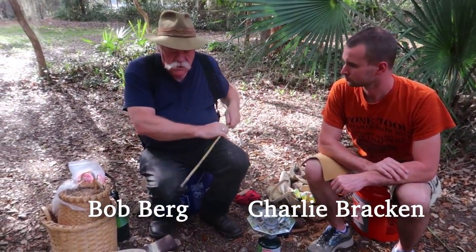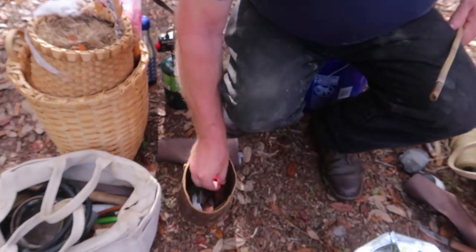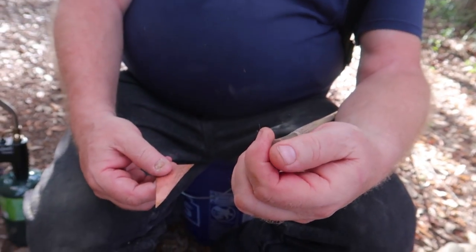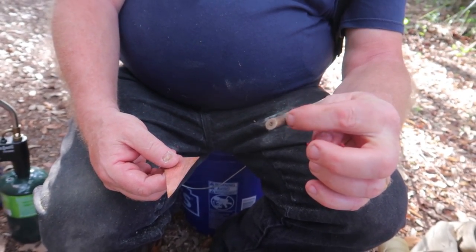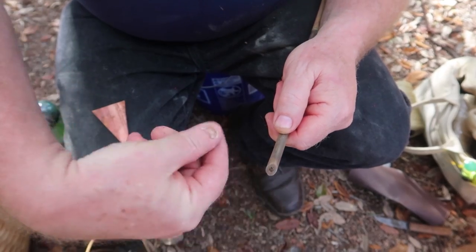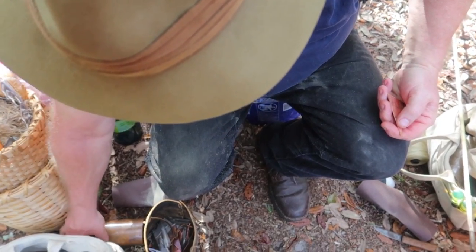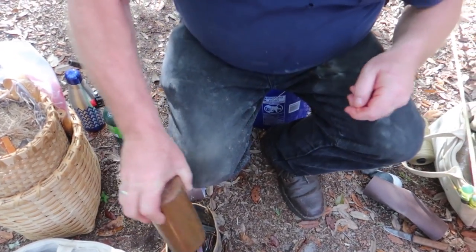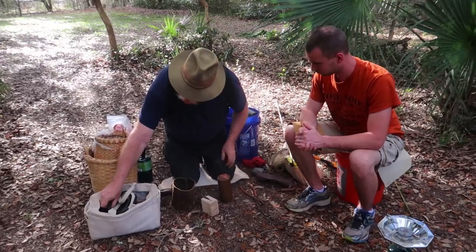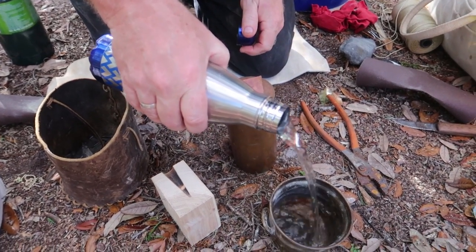On the other side we need to put a point here. The kinds of points I like on my darts are made out of copper. This is a triangle and I want to make a cone that fits it. It isn't a cone yet, but I'm going to create a cone shape by taking away some slivers of material, pinching it in, and wrapping it with fiber. When I glue the cone on there it all becomes very solid and hard. I'll show you how to make the cone-shaped dart point — something you've probably never done before.